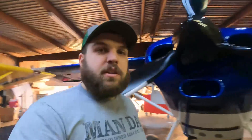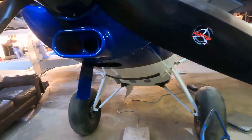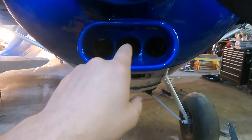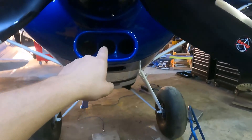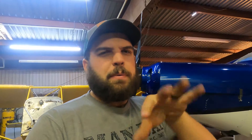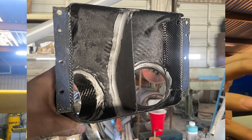The next is this scoop, which a lot of people have been asking about. If you look at it, it goes into three openings. The center hole goes directly into my air box and directly into the intake, so we get ram air effect on the air coming in, which helps maintain manifold pressure. These two outer holes both go into a three-inch scat. I have two three-inch scats that run down under the bottom of the motor, and then I have an air plenum on a big 17-row oil cooler at the back in the tunnel. It's split in half down the middle — one three-inch goes in one side, one three-inch goes in the other. It's a ton of air. You also get redundancy: if one scat comes off or gets a hole in it, you still have a big three-inch scat blowing into the oil cooler on the other side, so you're not going to lose all your oil cooling.